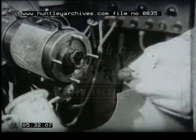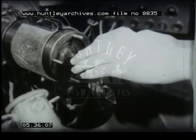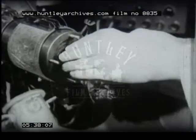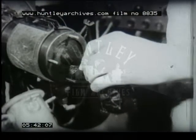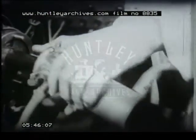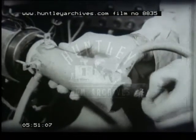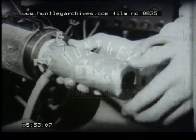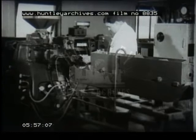In the centre of the die is what is known as the torpedo, through which air can be blown. As the material starts to come through the die, the end of the tube is closed, pulled out thin and hardened by cooling with a damp cloth. This is done to enable the tube to be fed into a sizing die, which consists of a water-cooled tube. This tube gives the pipe its outside dimension, for the air blown in through the torpedo forces the soft plastic tube against the walls.